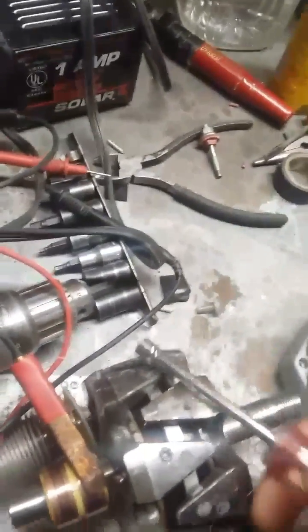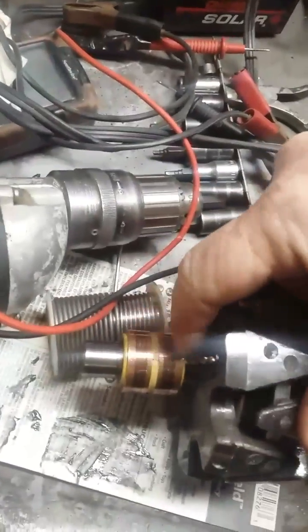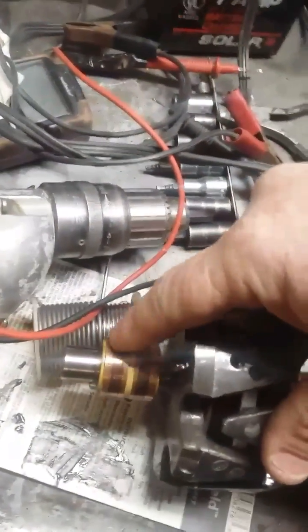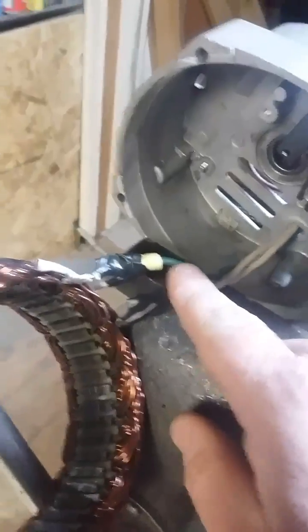Take that off and there is some residual magnetism because I've glued these magnets in there. By itself this thing is not enough — it has to have power applied to these two brushes before it begins to make power. That doesn't lend itself to wind power because you don't want these things draining your batteries while you're waiting for wind. By placing these magnets in there, I've created something that will begin to make a small amount of electricity. Once those small magnets begin to spin around the stator, they're going to create a little bit of current.